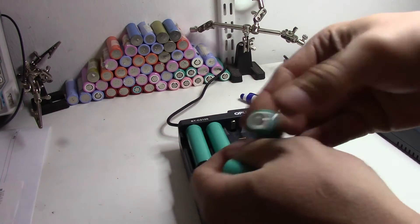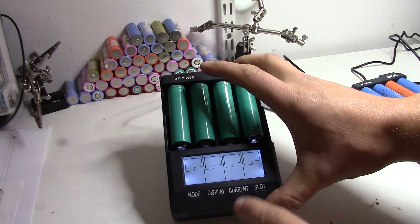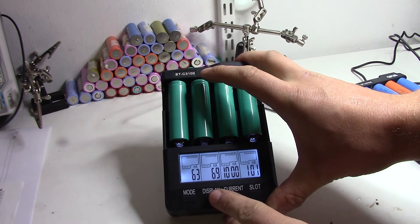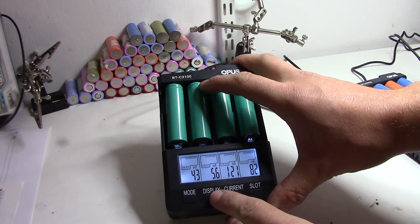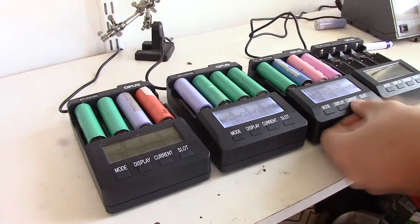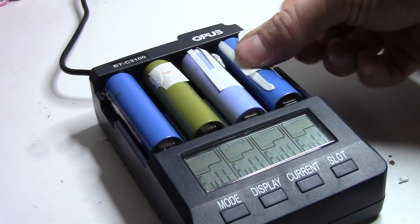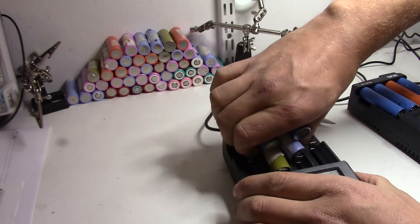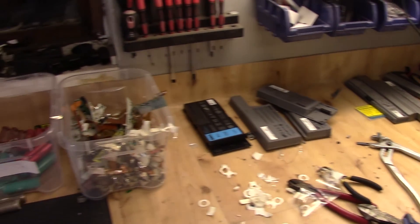So let's start charging the ones in the bin. Put it into my charger - I generally charge and test them with one amp. So let's run a one amp cycle. There it starts to charge. When they are done I mark them with some tape. The tape is just for being able to write the milliamp-hour capacity on them. When done, I sort them into different trays - in this case I sort them into one above 2 amp-hours and one below.